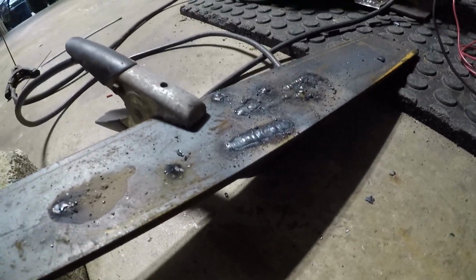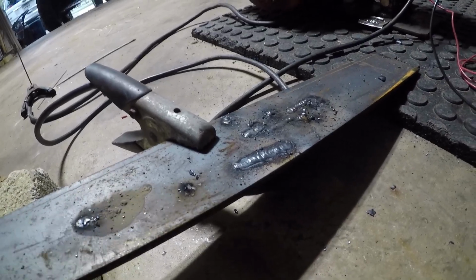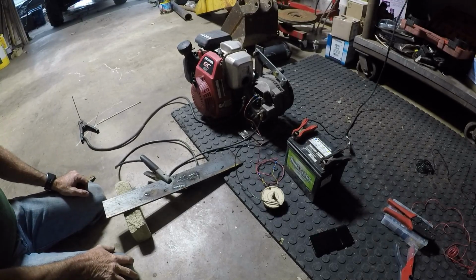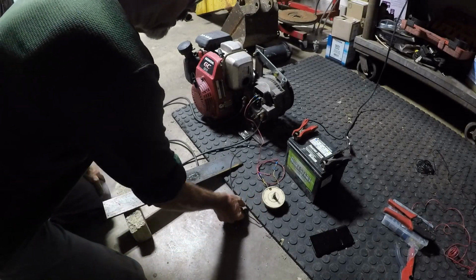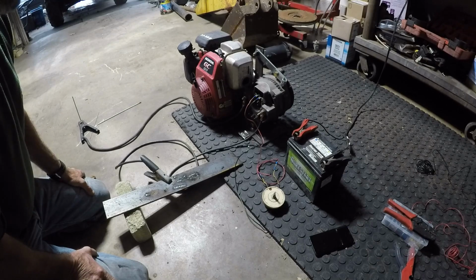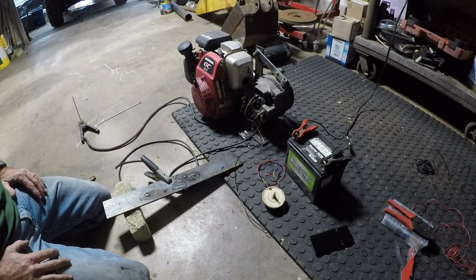But it acts like it's hard to keep a weld going. And I know the way I had it set up before, it had no problem starting a bead and holding it. I never had this problem of start and stop, start and stop. And that's running the 3/32 rod. Switching them isn't going to help anything. And it may just be that he put different diodes in it. I know they've got heavier duty diodes that would handle more amperage. I don't know.